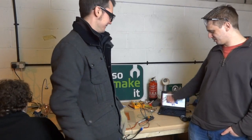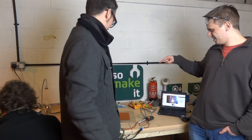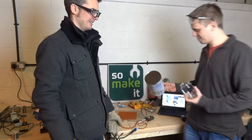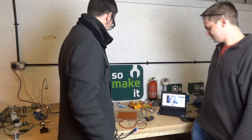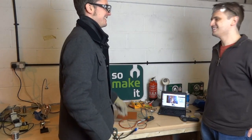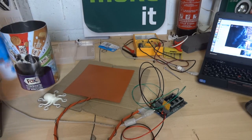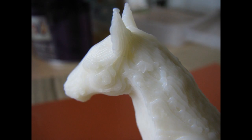James and I have been working on this. So here we've got an Arduino and RAMPS, which is the Reprap Arduino Mega Pololu Shield. It thinks it's a printer, but it's actually just a heated bed. And we're going to use this to heat up either a glass jar or a metal tin to do our smoothing. What we're going to do is produce acetone vapor to dissolve the surface of ABS 3D printed parts to make them nice and smooth. So what have we got on the bench? That's the heated pad. We've got acetone, and we've also got a container to put the acetone in and a glass jar, and the 3D printed parts in ABS.